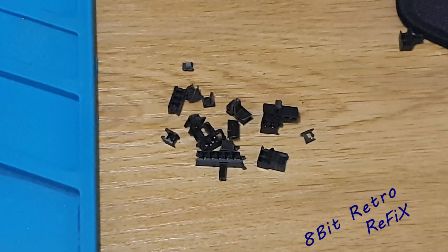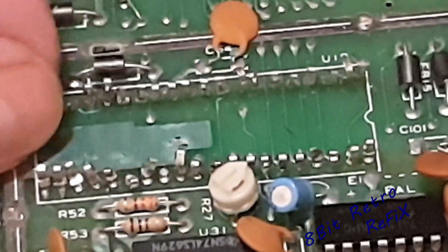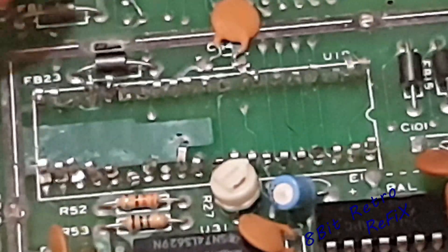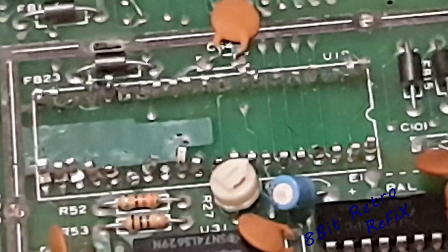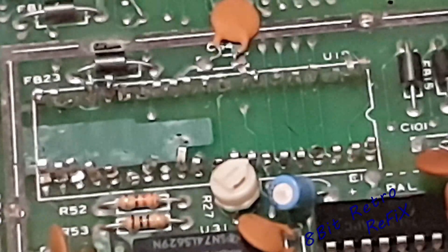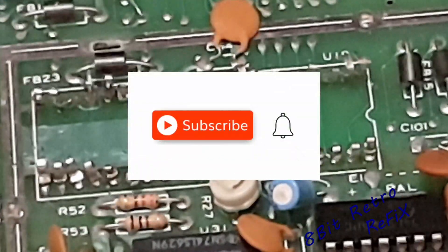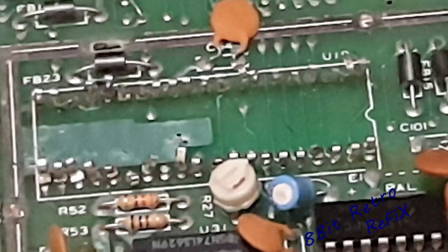So that's what's left after we've removed the outer casing of the socket — you can see all the pins still sticking up. This is a really good way of getting these big chips off. You get the desolder station on it and just buzz them all off. At least you can get to all the sides; if needs be you can snap them off and pull the solder through the hole. It's very much less invasive to the board, even though it looks rough doing it this way.